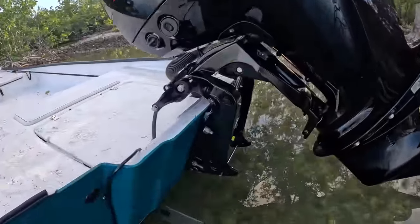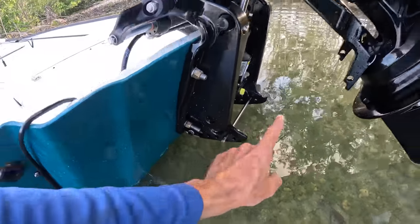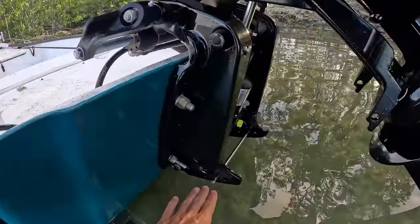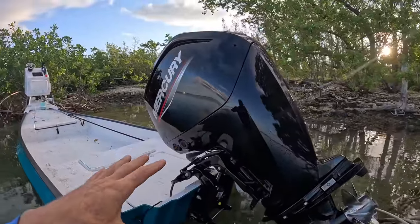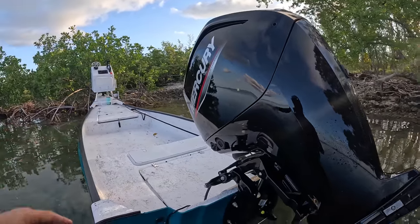Something important I did want to mention — after people saw this video they've been emailing me and leaving comments saying they're going to build their own. You need to understand that's not where the helm is supposed to be. It does offset the weight a little bit; the boat rides different. It's a flat boat built for calm water, so if you're in rough water or don't know how to drive it, the nose will dig a little bit. Something we did to help prevent that are these — they're called thrust rods — and what this does is prevent the motor from trimming to a negative trim, because if I trim too negative it's going to bring the bow down and you don't want that bow to grab. I put a 90 on this mainly because it's the same weight as the 75 and wasn't much more, and a bigger motor is going to help offset that weight in the front.